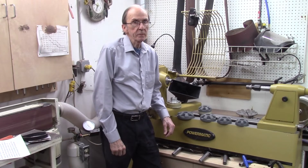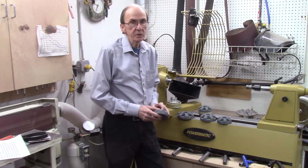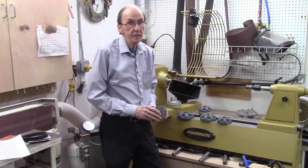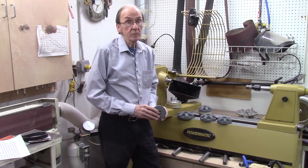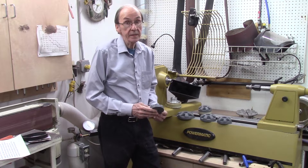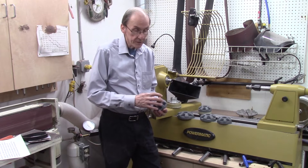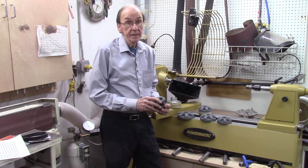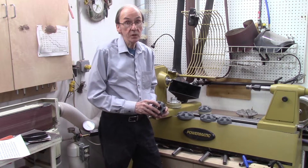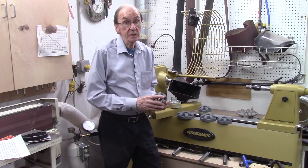In this video, I was quite concerned about the structural integrity of these faceplates. Could they survive the abuse and treatment of actually turning samples on a lathe without shattering, cracking, or causing possible damage or injury? So I made some changes to the design of the faceplate to make it as strong as possible. I used the Fusion 360 software to design some unique patterns for these faceplates to make them really strong, and then made some additional changes in the 3D printer software, again to make a faceplate that is as strong as possible.